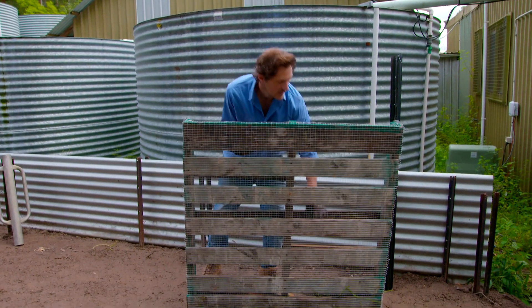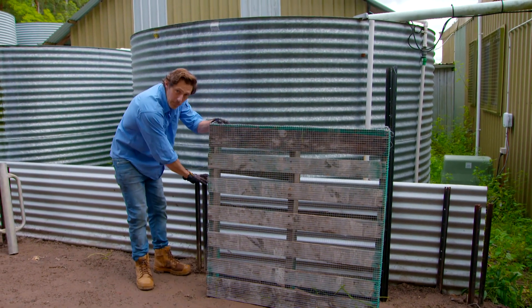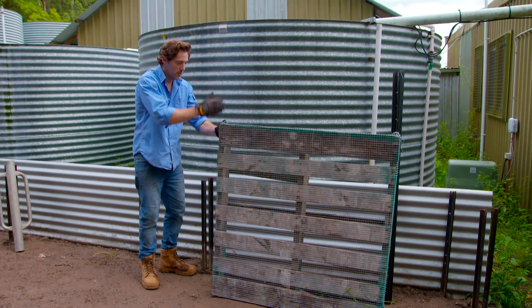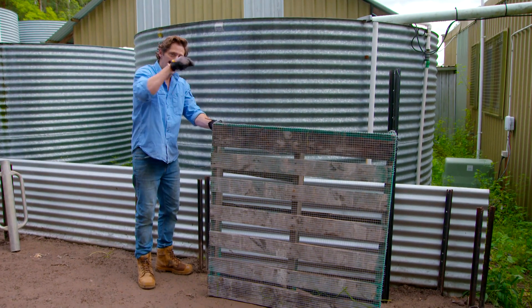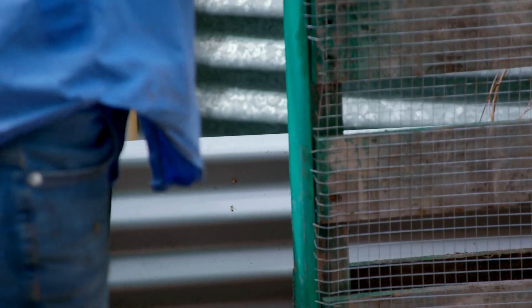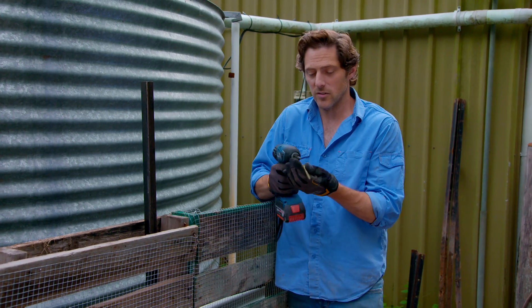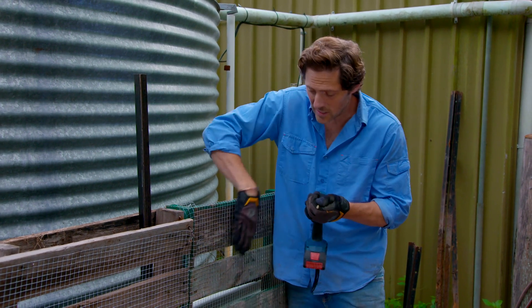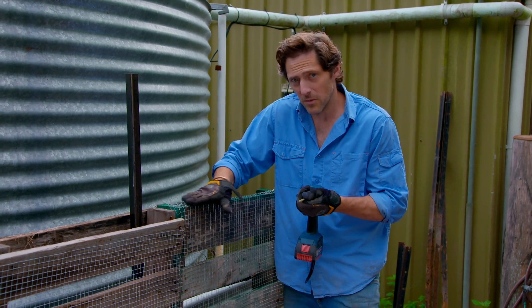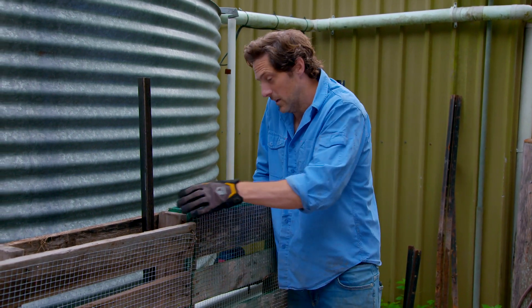Step one of building our bays is to get our back line in first. I've already put in a couple of star pickets as my starting point, which I'll thread this over, and that's going to allow me to work out where the rest of the star pickets go. I'll bang them in and then put the sides on. Before I knock in my star picket, I'm going to screw it together with a bugle just to keep the face nice and flat and the top nice and flush. Remember, we are working with pallets, but this does help a little bit.